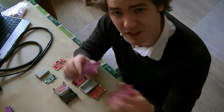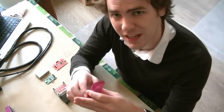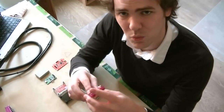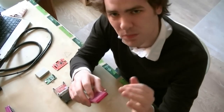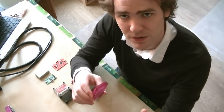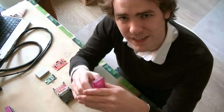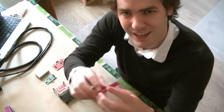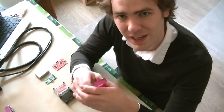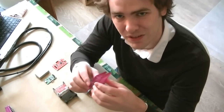Making these is actually fairly inexpensive — we could have them molded for $0.50 to $2 a piece depending on quantity. The problem is the mold costs a fortune: $5,000 to $15,000 to get the molds set up, which is way beyond what we're able to do. However, there's a company called Proto Mold that specializes in rapid turnaround molding — they can make a prototype mold in less than 24 hours. They have a Cool Idea Program where we can submit an idea like this Bus Pirate case and they might give us the mold for free. Later today we're going to post our draft appeal for the free mold — take a look and leave comments, and we'll keep you updated.